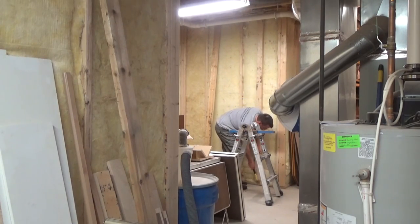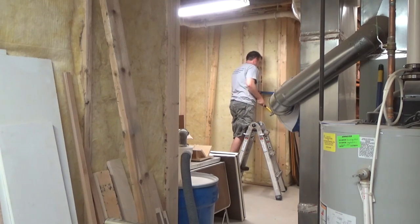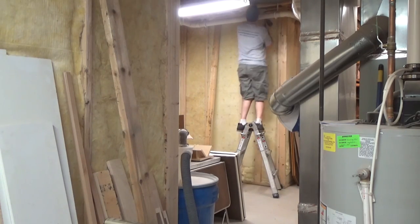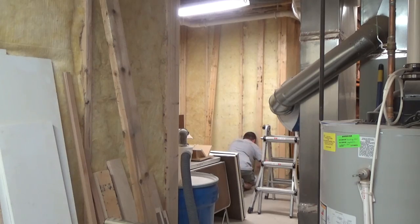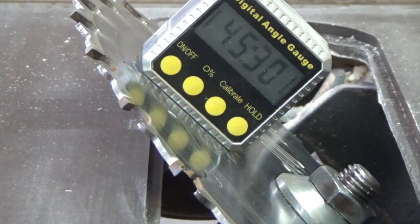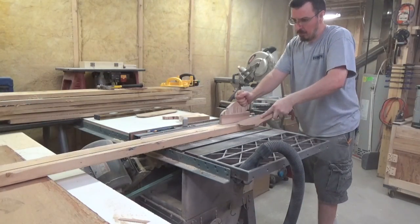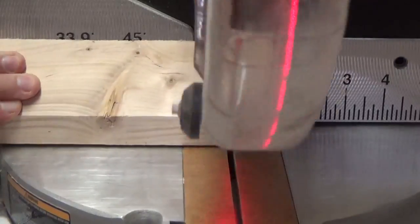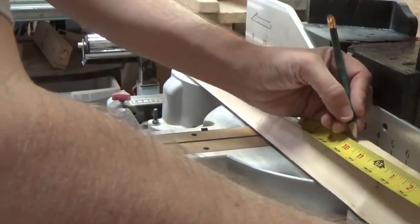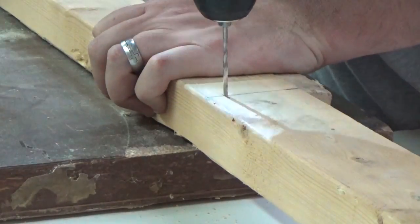They're framing a few houses in my neighborhood, so I was lucky enough to find every piece of wood I needed for this project in the dumpster. Granted, it's only like 20 or 30 bucks in lumber, so I'm not exactly sure it was worth being neck deep in trash. But I found everything I needed, including two new studs to beef up the wall just a bit. I set the table saw at 45 degrees and ripped down three more 2x4s to make all the wall cleats. If you cut right down the center, you can easily get two cleats from a single board. Then I take each one over to the miter saw, clean cut one of the ends, measure out and mark each of the six cleats, and trim them to fit. I transfer the location of the studs onto each cleat and mark where I need to drill pilot holes to mount them.